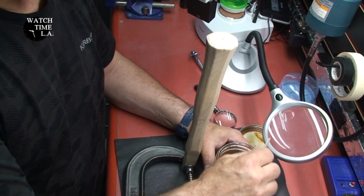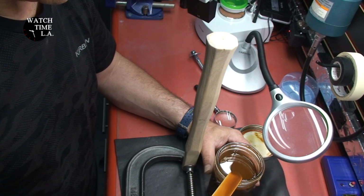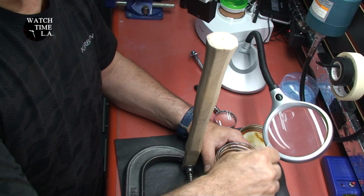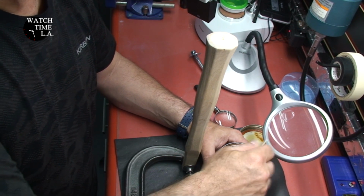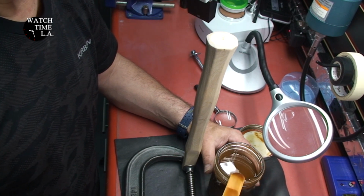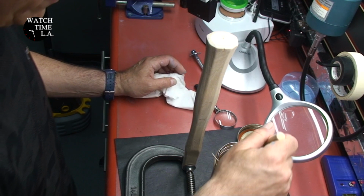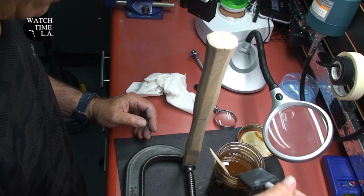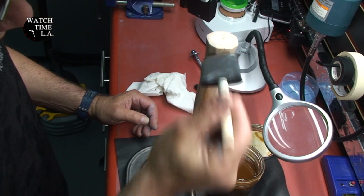So I do want to get this thing an antique looking. I don't know how many coats of this I'll use. I will tell you that the varnish portion of this is about 50% mineral spirits, and the rest is a colored stain. I'm going to use a foam brush to try and avoid the bubbles that seem to always happen when you use varnish.